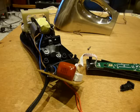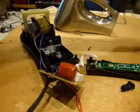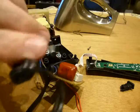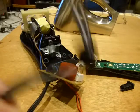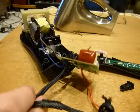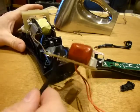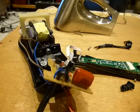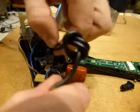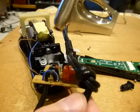There's more electrical troubleshooting to be done on this mixer because the cord is not at fault. First I thought, when I was bending the cord and manipulating it, that this was causing the motor to run unevenly and cut power on and off, but later it turned out that it wasn't the problem, and I'll tell you what happened here. First off, when I replaced the cord, I just cut out this UL knot part that the insurance company wants, and I thought maybe the wires are broken on the outside, on the tension side of the knot.